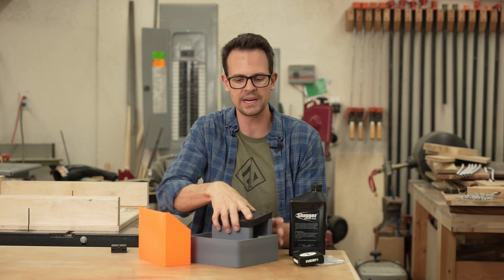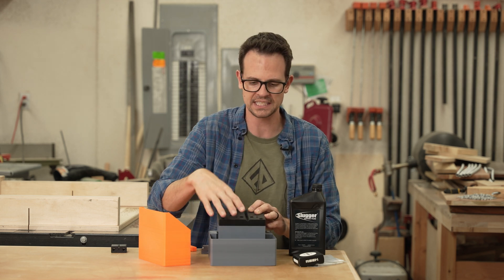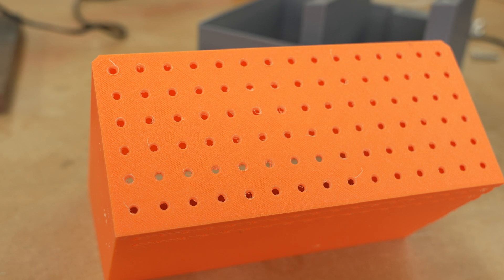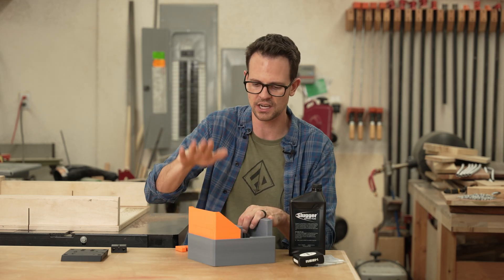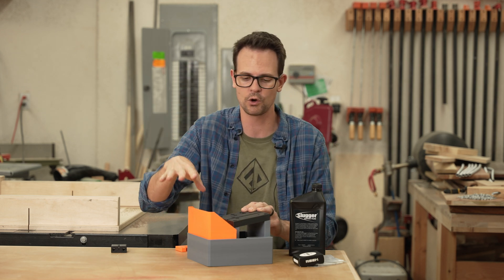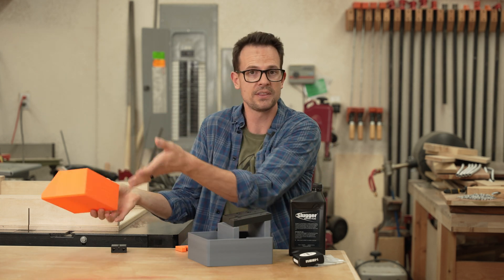I've also put the post portions where I'm holding up the plate angled at 10 degrees, so it should be easier to feed in the wire spools and they'll fall in more directly. I also have put back so that the V-groove goes the whole way. I made this bin for it that has holes on the bottom and on the sides so that coolant can get out, and then this just comes in here so that when you are cutting the rings, they can bounce off and hopefully get collected before flying all over the place. When you're done, you can take this out, the coolant will drain into here through the holes, and you can just dump in the rings.